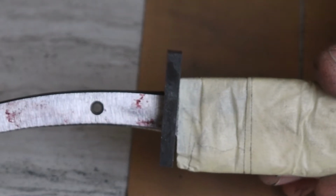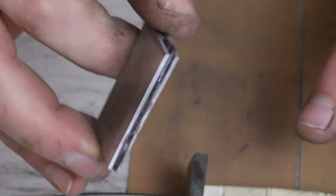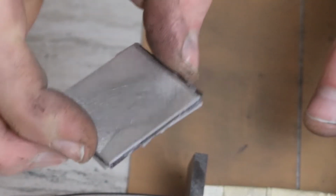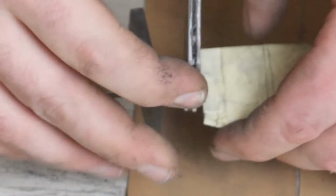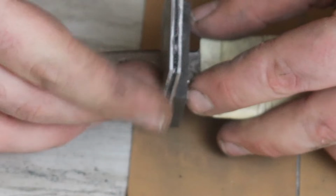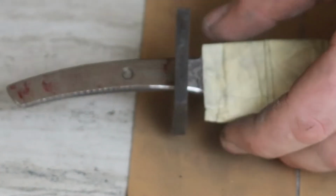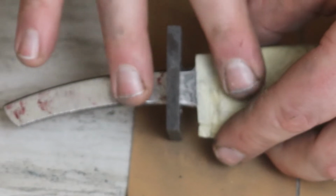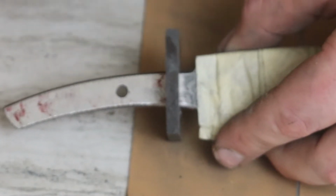So what I have done is taken some pieces of aluminum and layered them with a black G10 liner, made two of these. I'm going to use them as spacers in between the Damascus and the blade, and then I'll put another one here at the base of it before the black linen micarta handles extend out from it. I think that should give us a really nice focal point on the knife, and it'll be right where we want it. So this transition will be really interesting looking.